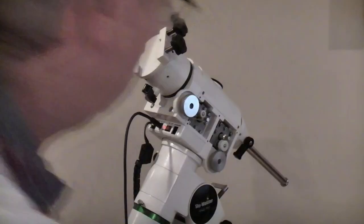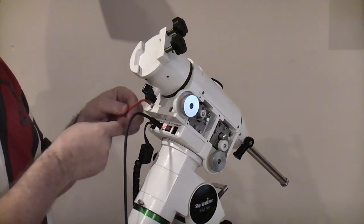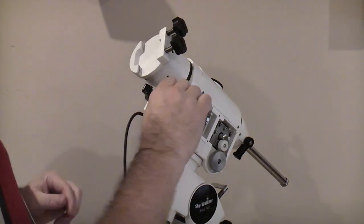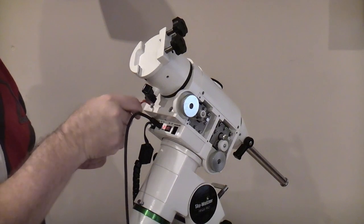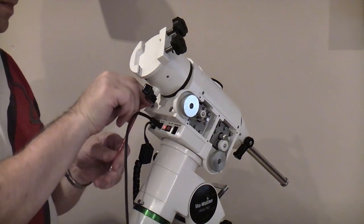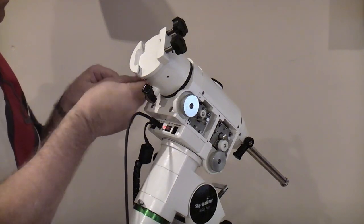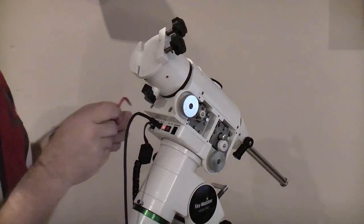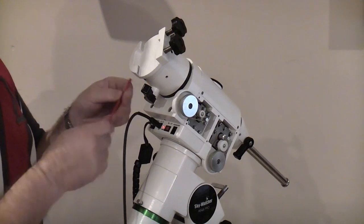So that's sounding good. So I'm now going to tighten the 3 large screws that hold the worm carrier on. Really important here that you rotate round the 3 screws, turning a small amount each time. Don't crank one down, then the other, and then the other. Just put a little bit on each one and rotate around and rotate around. It's a bit like the cylinder head on a car. You don't want it to shift its position while you're doing this. So you just rotate around